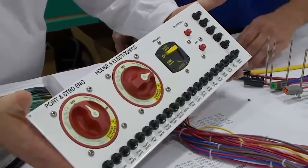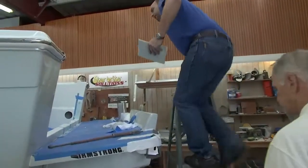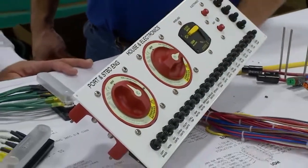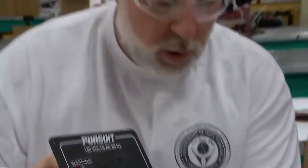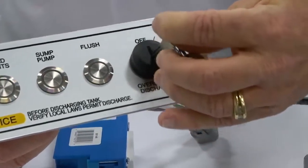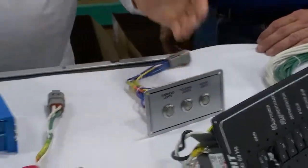Where are we going to be installing this into the craft today? This will be in the port aft transom area — quick, easy access as you step on board to turn on your battery switches. All high-quality Blue Seas components throughout, making it trouble-free for the customer. This is the AC distribution panel for 110 volt shore power. That will actually be installed inside the head — for your lights, sump pump, shower, and toilet systems. The key is for a Coast Guard requirement on overboard discharge: the captain needs a mechanical lock, so instead of a padlock on the seacock, we use a key, which is considered a tool.